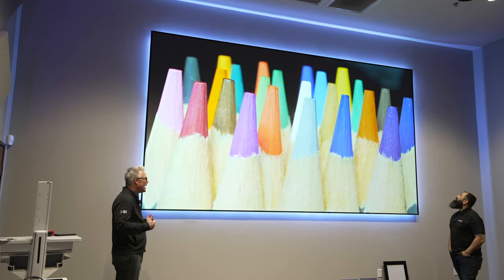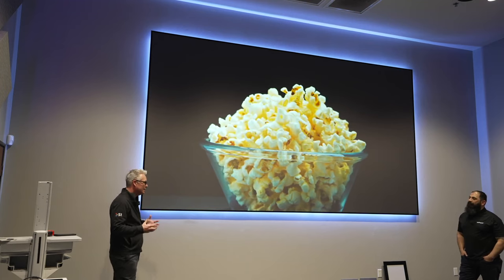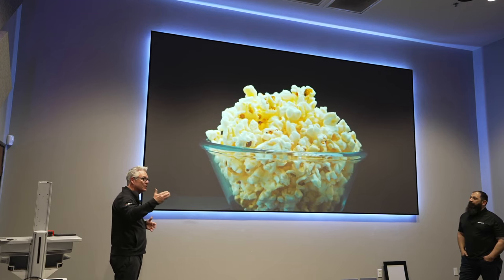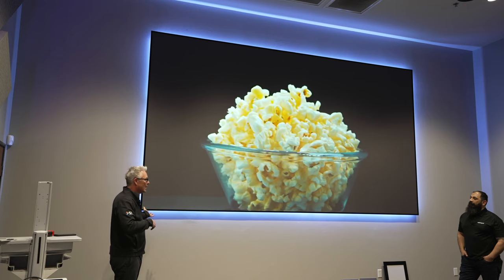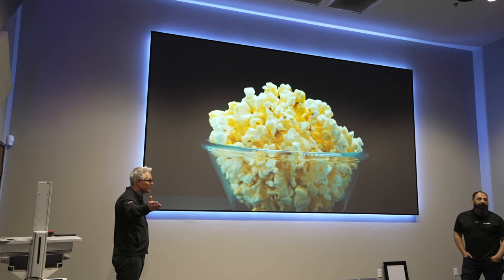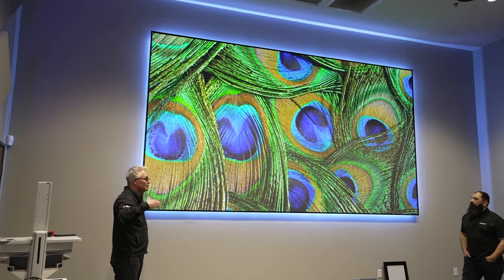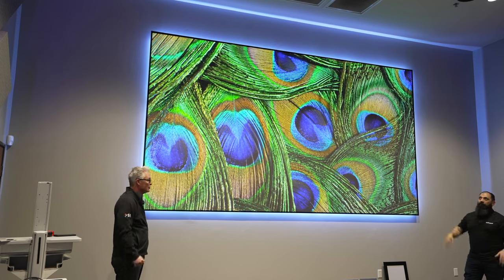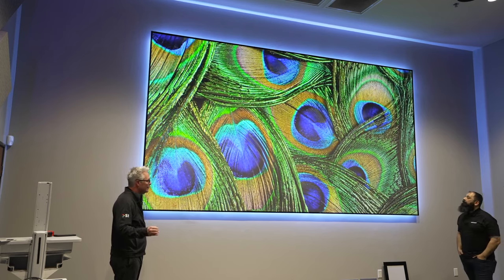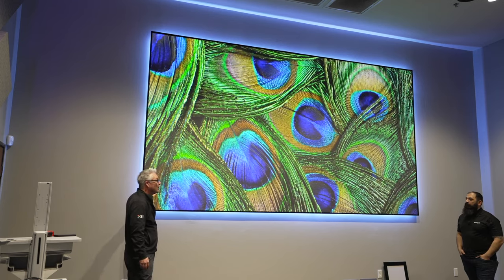So there's so many boxes that carbon black checks. Really, the only thing to be aware of as a designer is it requires lumens. So for instance, what you would put lumens on a black diamond, you need twice that for carbon black. Simple math. So for instance, right now we've got 32,000 lumens available to us. We're using 20,000 lumens of what that projector has. But again, be thinking higher lumens than you're typically used to when it comes to lights on. It also requires a native 4K image. Because it's a woven material, you don't want to go down to 1080p or you run into some more issues.